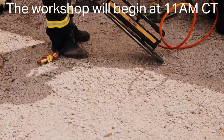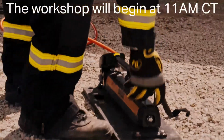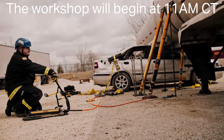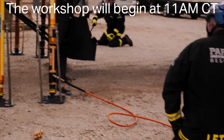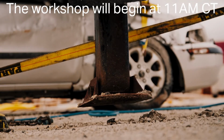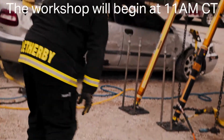Attach the pump. Make sure the pump is open before you attach. When we do the lift using the hydrofusions, we need to go simultaneously. Line of sight is always the best. You ready? Yep. Okay, let's go. We really need another 2 firemen to work the stabilization. Okay, you're only going to lift as high as you need. Lock all your collars up.